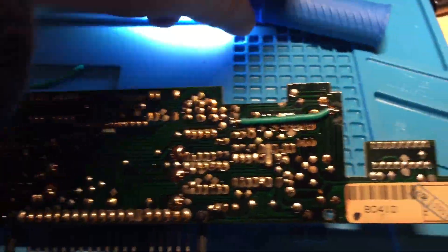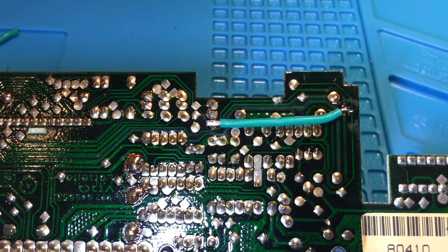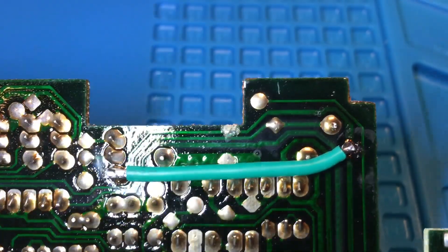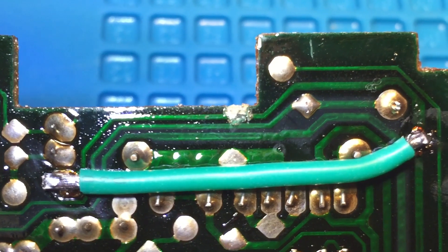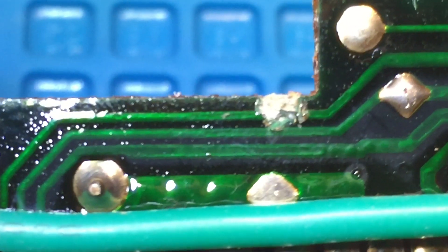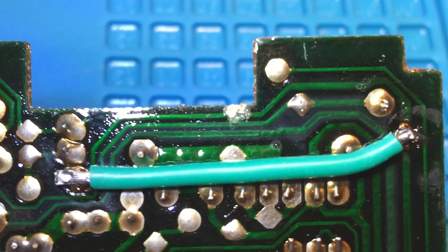This is my 1991 M42 318i E30 SI board. I saw a video of a guy that said to use the wrong screws and it does this, but the screws are exactly the right ones — and yeah, they cut into the SI board and cut one of these traces.